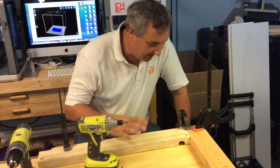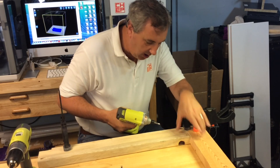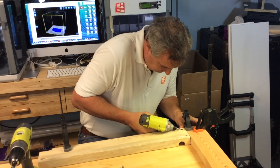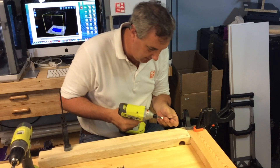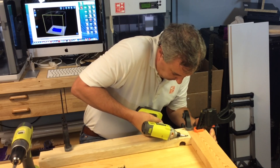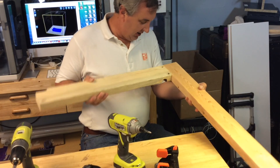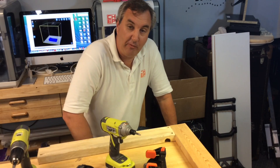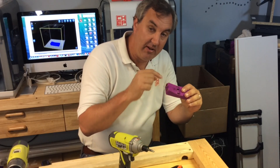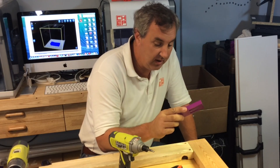Now the most important part — connecting the wood together. I got my impact screwdriver and a screw lined up, got my wood all clamped down, and I'll just drive it in. A nice solid joint. Overall it worked pretty well. Now I could make a couple of different ones of different widths and even different angles for thicker wood — there are so many different things I can do now that I can print my own pocket hole jigs.